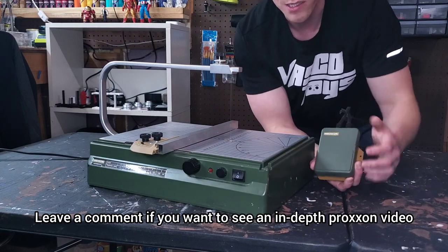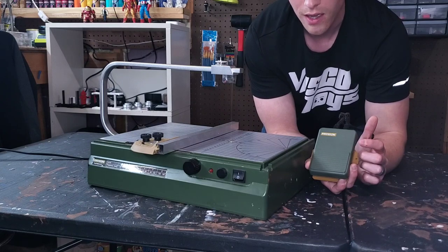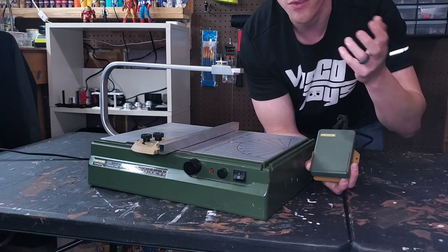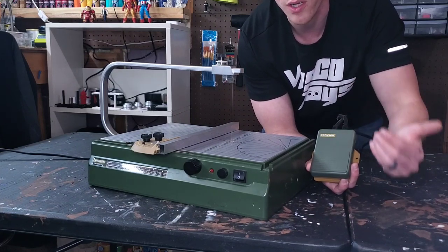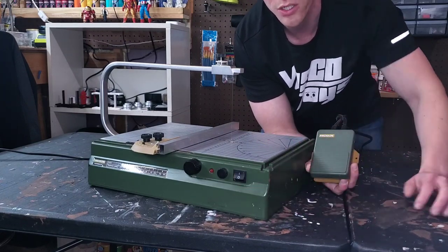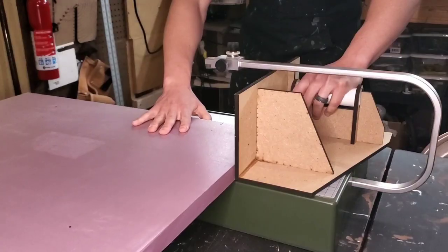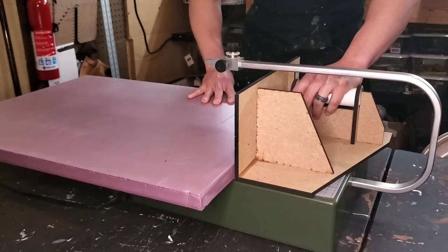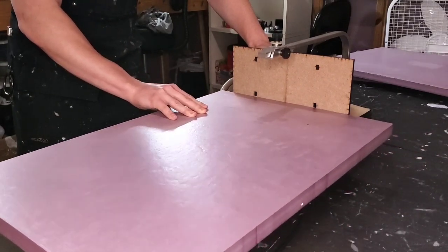And then as an added enhancement, with the foot pedal you can really control the heat of the Proxxon as you're cutting the foam by switching it on and off. If you're cutting angles or odd shapes, the foot pedal really comes in handy because you don't have to keep your finger on the on-off switch — you can just use the foot pedal to control the power. It's also important to note that the guide by Shifting Lands really enhances the Proxxon, as the original guide is not very good and can sometimes be frustrating.